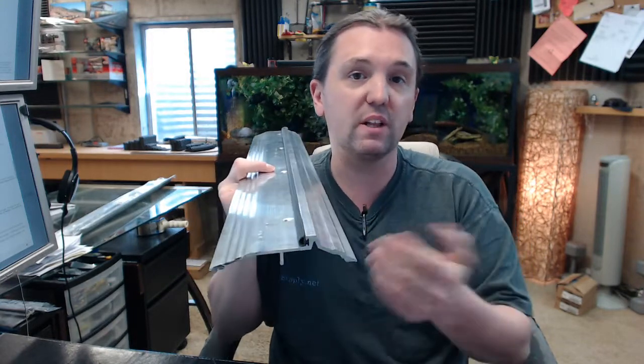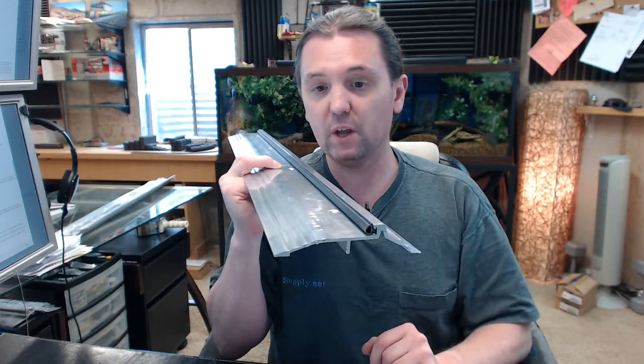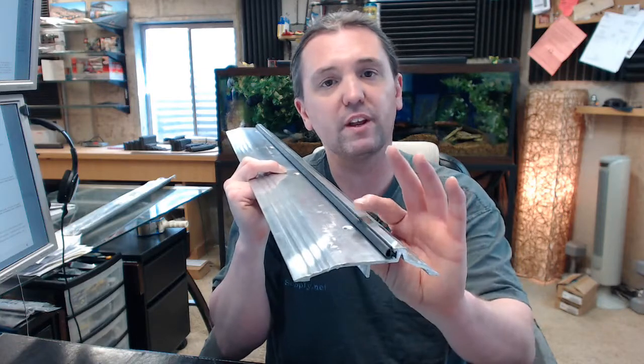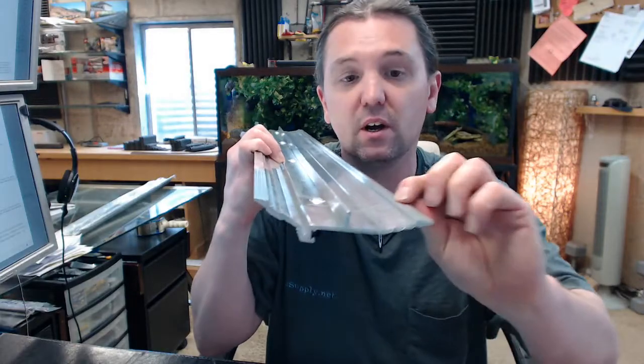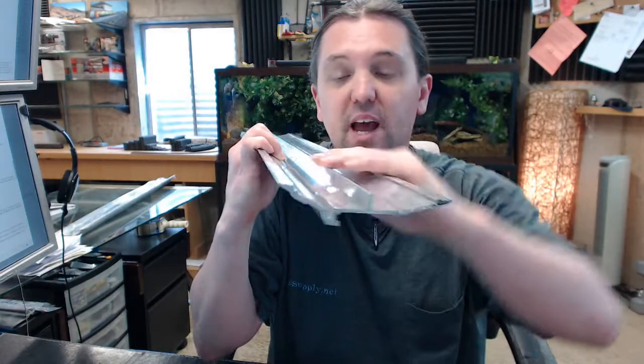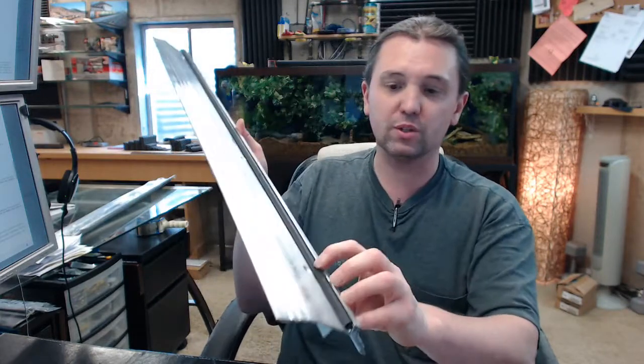Emergency exit doors typically don't need to comply with handicap requirements because it's not a point of public access, but the point of the matter is it's a latch track for that purpose alone. And most bump up thresholds are going to be compliant with that, although not all. You get some that are very short in their height, and that ability of it to be a latch track threshold goes away. Okay, 5 inches very common. I like the National Guard product because of these almost serrated edges down at the bottom, and that really bites into the concrete and keeps it from moving, because really all you have are screws holding it down.